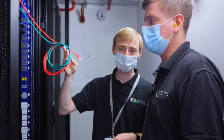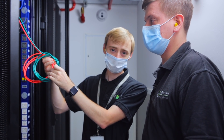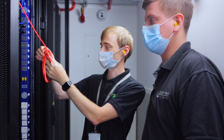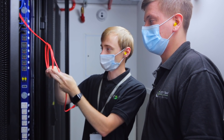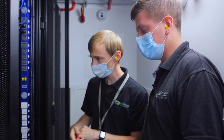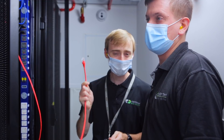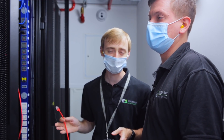As standard we provide a red and a green cable, and they normally come with labels so you know what's what. We tell the customer what label is which device, so if there's ever a problem we can quote a number to them and they know what the connection is. The idea is we connect one cable to one switch and one cable to the other switch, with an interconnect between the two. If one of these dies, everything should still stay online if you configure it properly — and that's what we're going to look at today.